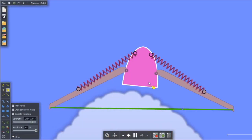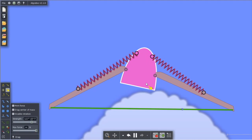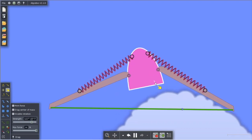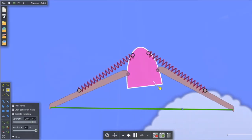So in the end you can keep the tension, and probably they can also adjust it — placing the windward shrouds as far forward as possible to compensate and keep the mast upright, so not falling to leeward, and probably even achieving some negative heel. We know the mast is placed on a ball, so it's not only rotating in its own axis, but can also rotate windward and leeward, transversally. So it's possible they can position the spreader much further forward and try to have the mast less heeled than the boat.